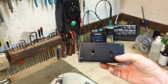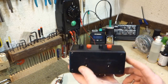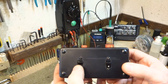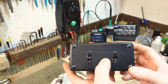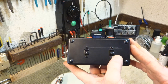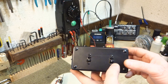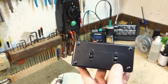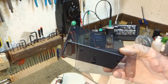Now if you want to make a much simpler version, you can just get any electronics project box and wire an input and output quarter-inch jack, input and output banana jacks, and now you have a switch that goes between quarter-inch and banana plug or probe input, and amplifier versus meter output. Not quite as ornate and elaborate with all the bells and whistles, but it does the job just as well when you want to troubleshoot an intermittent problem and switch between listening and observing readings instantaneously.